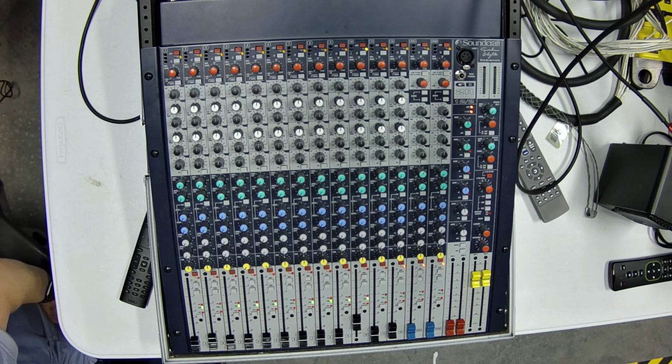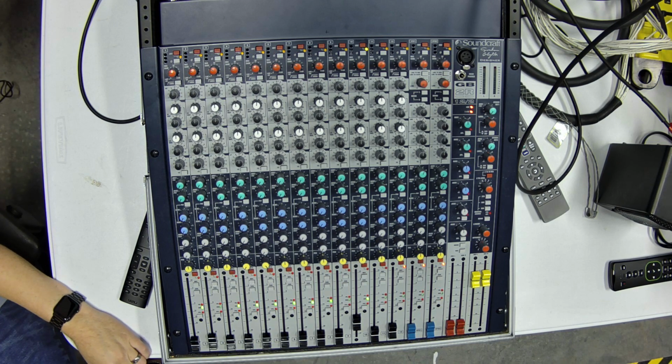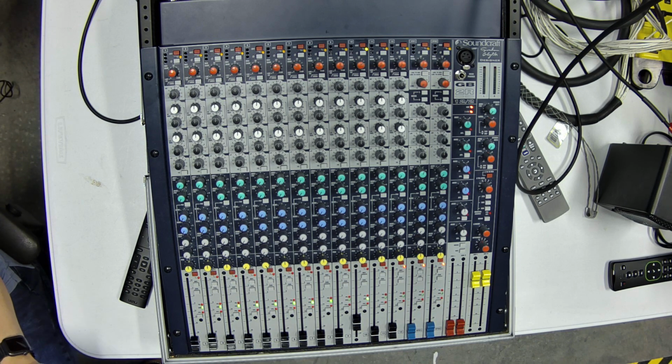Certainly it is dependent on the signal. For people who have higher pitched voices, I could probably get away with sweeping that cutoff filter a little bit higher, and I absolutely will do that. For lower voices, I might not be able to get away with it. But what I tend to find is, certainly for musical theater, the things we're trying to amplify and really deliver to the audience are frequencies in the range of 1 kHz to 4 kHz. That's the range that we're having a hard time delivering, and that's what we focus most of our attention on when amplifying and delivering to the audience. So even if you're cutting out some of the content that their voice is naturally generating, that's probably not the material that's having a hard time getting to the audience.